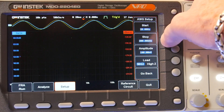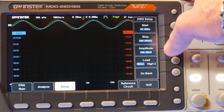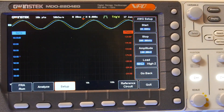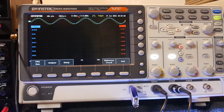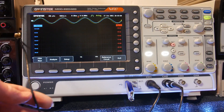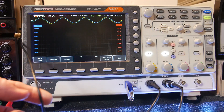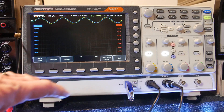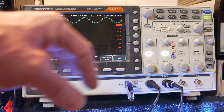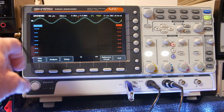One watt is loud when we hook it up to the amplifier. The generator is going to sweep from 20 Hz — that's as low as I could go — up to 200 kHz, so we'll go well past the audio band. I want to see where this class D operates. It's going to be 140 millivolts in amplitude. The lead coming from oscillator output 1 goes to our input — I'm using this to sweep the frequency and plot the Bode plot.